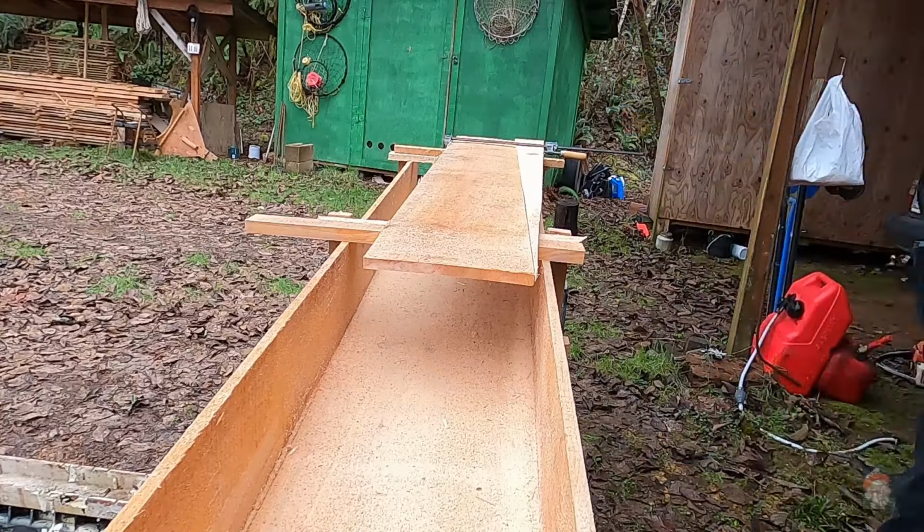This is 1.5 inches. The one on the bottom is just, I cannot cut within 1 inch of the bunk. So I need a riser there. 1.5 inches here. I set the blade on top. Note that on the scale. Crank the scale down 1/2 inch. Subtract the kerf from that 1/2 inch, and I've got a 3/8 board, 1 inch remaining. Go down another 1/2, and I've got a 3/8 board and 1/2 remaining. That would work. And then I thought about it some more.